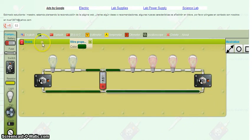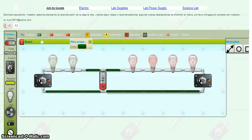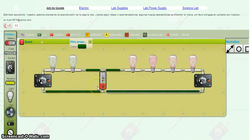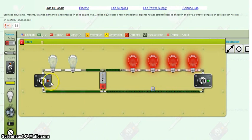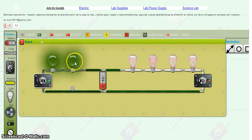I know some of you like to change your background color — maybe we'll go to a black background or a reddish color. I'll keep it tan. You can always change that if you'd like. You can see we have one circuit over here and another circuit over here. They do operate on their own switches, so that's step number one. We have one loop and another loop. Two separate loops allow them to work off the same battery. If one of these bulbs burns out, it's not going to make the other side go out, which is the beautiful thing about a parallel circuit, or what we call a multi-loop circuit.